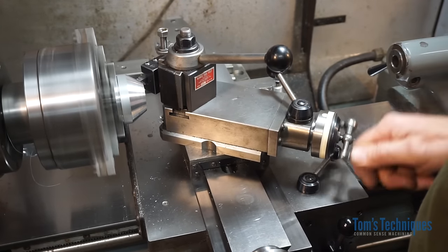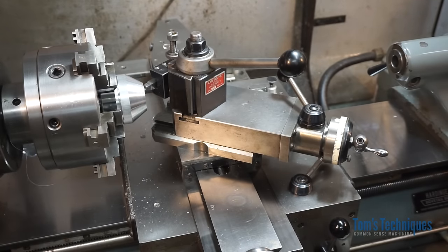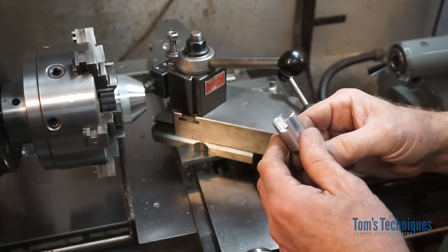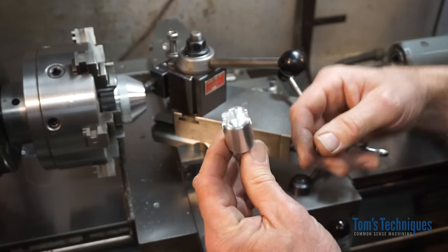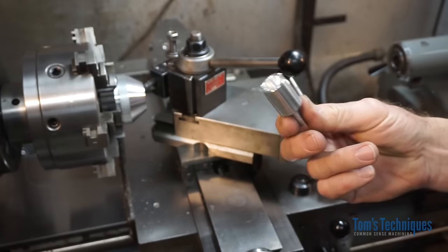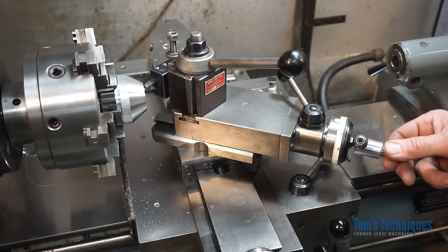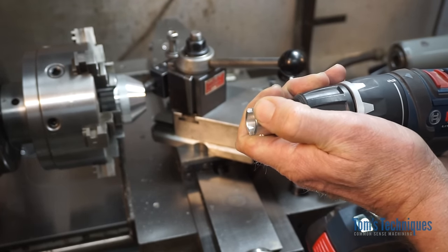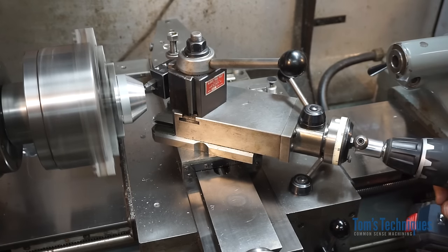What I've come up with for getting a better finish in a situation like this is a little tool I made. A few minutes spent on a tool or a fixture can save you hours or greatly improve your work. All this is is a little socket — just a piece of aluminum with a hole drilled in the end of it, and a notch milled crosswise, and then a little shaft turned on one end. This socket fits over the crank on your compound rest. It's purposely sloppy, so you don't have to line it up perfectly. Then just take your cordless drill, mount the socket in it, and you've got an instant power feed.